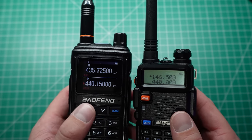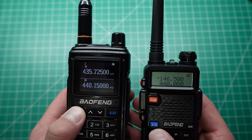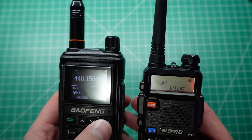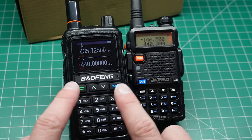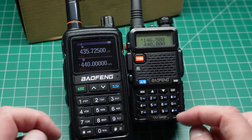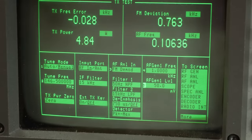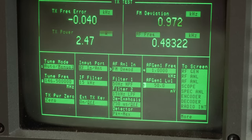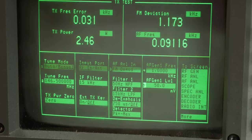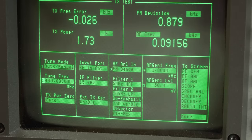Comparing the two screens between the UV-5R and the UV-17: the UV-17 has a much nicer, cleaner-looking colour screen — a little bit more modernised. Let's TX and we get 4.83 watts, which is what I'd expect from a 5-watt handheld. There are only two power settings: high and low. Low is 2.46 watts, about half way. On 440, high power is 4.35 watts and low power is 1.73 watts.